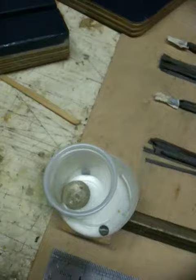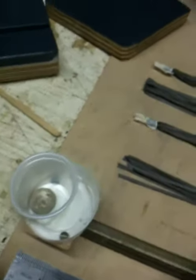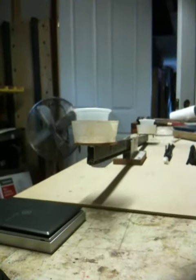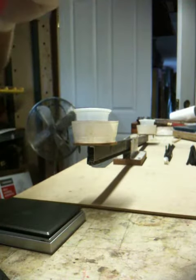I've just got four coins — it's a 3-to-1 mix for the epoxy. I put one coin in here; I like to do the hardener first because it's most critical percentage-wise. So I put one coin in there and then we'll just balance it up with the hardener.